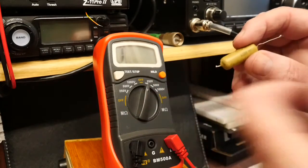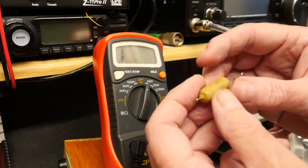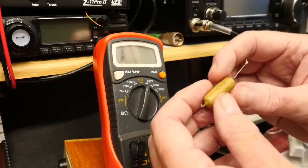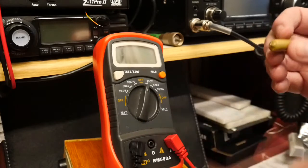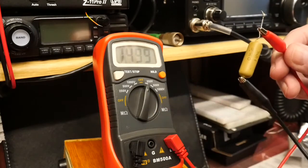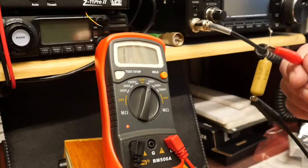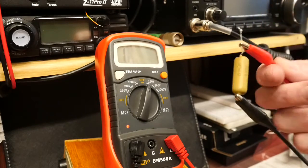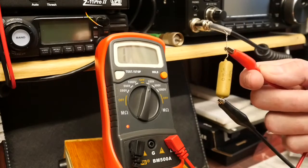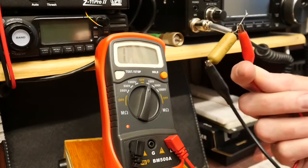The other ones you sometimes come across — Uncle Doug calls these mustard caps, and he's got an amazing YouTube channel about valve amplifiers, well worth watching. They're polyester, and I remember these being quite common. I had a Philips electronic engineer kit back in the early 70s and that had these capacitors in. This one is a 400 volt, 0.1 microfarad, removed from some 1940s kit that had been modified a little bit. Popping that on and running test at 250 volts — as you can see, that's completely open circuit, exactly what you'd expect. Nothing wrong with that capacitor. If I come across those in radios, as long as the value tests out okay, I shan't bother replacing them. I've got a stock of old but never-used ones, and I've checked a few of them and they're the same — good, reliable capacitors.